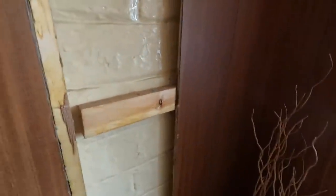Adam's taking these off now. I'm going to run around, set my blade just slightly shallower than the wall, just to get these out. You can do it on all of them and then chase the boxes into the walls in here as well.